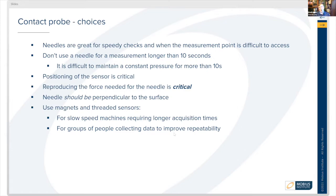It's really challenging because ultrasound is directional — whether it's in air or structure-borne. When you put a needle sensor on, you want to make sure that the angle is the same every time you do it.